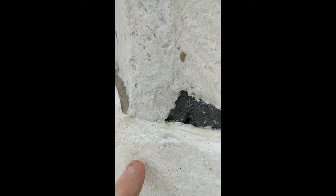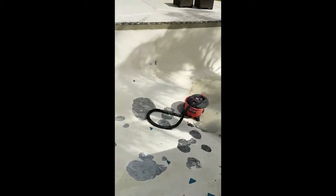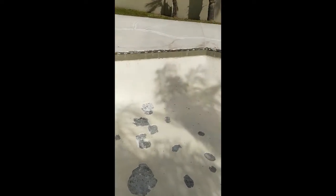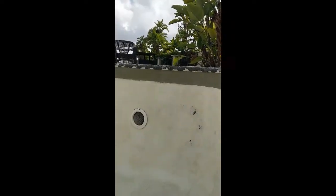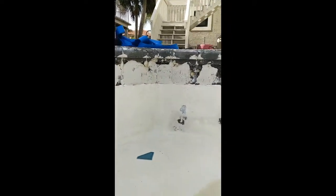You can see just little tiny holes — I don't know if they're anything or not, but it just feels porous and I'm not going to take a chance. I'm in the middle of putting in the brown coat where the tiles go. The hydraulic cement I'm using is called Cement All — they sell it right at Home Depot, about $24 a bag for 55 pounds. This is what it looks like when it's ready for tile; after this it's time to tile.